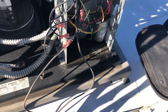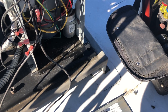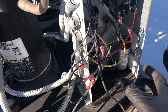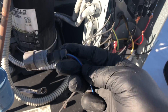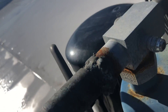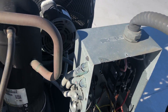Start ripping that stuff out of there. Your contactor. There's already a head pressure switch on this system for a high head cutout, so that comes in right here. We're going to put that in series with our low pressure switch, which is going to go on here. Because before it had the transducer — this transducer was talking to this control right here. Low pressure. You can see it's got the Schrader connector in there, and there is a Schrader connector on here, which was nice. And then the only other thing we have to add is a fan cycling switch for one of those condenser fan motors, and I got one on the truck.